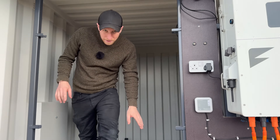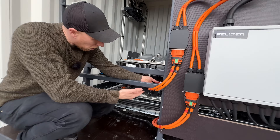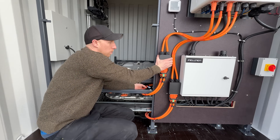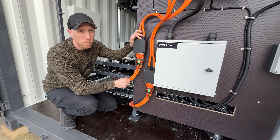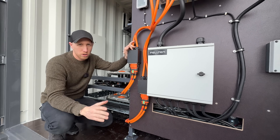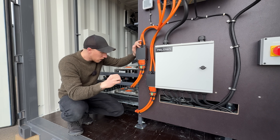Obviously, these have had the pyro fuses replaced. ChargeCube then plugs in here to the original HV connectors on the battery pack — the ones that would normally go to the motor — and they go into a junction box. Tesla uses aluminium cable, which is not that common, so we go from a connector with the aluminium into copper going into the inverter, just to stop corrosion long-term and make it super reliable.